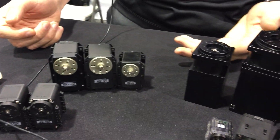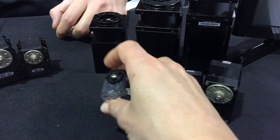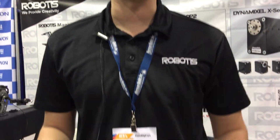For anybody who's used a servo before, you use an analog signal. You send that to the servo, the servo tries to get into position, but you don't know if it actually got there or if there are any problems until your plane crashes out of the sky or your robot structure crashes or something like that.